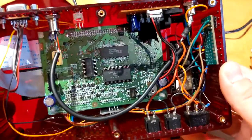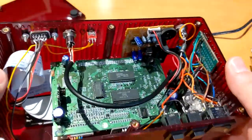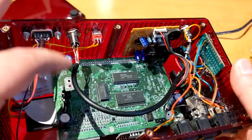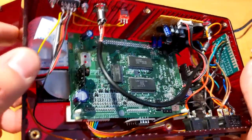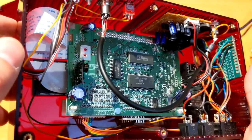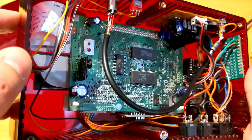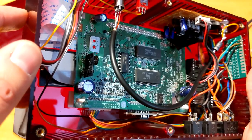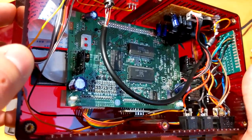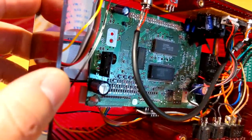And then you have obviously in the middle the main board. To make it fit, I had to relocate all the big through-hole components. So you have the caps on each corner, and you also have the DC-DC converter that I had to relocate on the back. This one is a bit hard to desolder, so even if you use Chip Quik to unsolder it, it's very tight in the hole of the motherboard. So you have to heat it and then quickly shake it out of the motherboard. But with Chip Quik, it's not a big issue. It stays molten for quite a long time when you heat it properly.